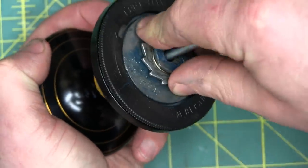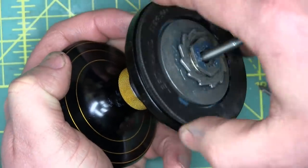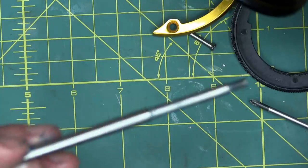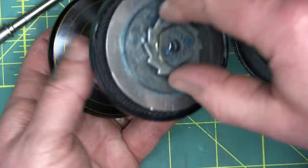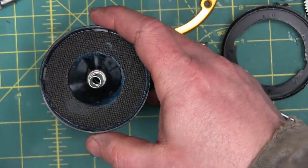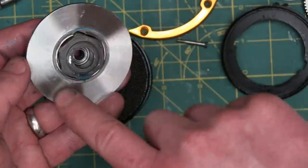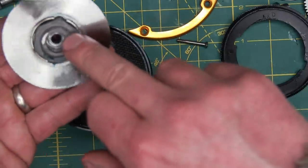Here we'll get into the brake — this is the claim to fame. It is very smooth, no stiction, but it could just be friction material full of grease, which would make it nicely smooth. So that is the shaft that gets pulled through. Here's the automotive clutch material — it appears to be some sort of phenolic resin impregnated fiberglass — super high-tech. And a stainless steel brake disc, not Blanchard ground but ground around the OD on the face.